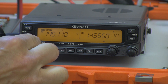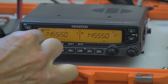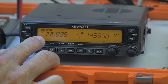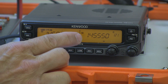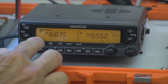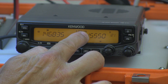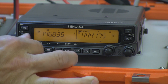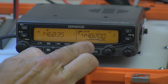As you can see here, here is your channel number. We'll take it back to channel 1, which is 146.835. This here is the PTT and the controls — so if I was to key up the radio, you can see it there. That is on the A band. If I want to go to the other B band, I simply push this button and the PTT and the control moves to that band. Let's take this down to channel 2: 443.200. You can see it's on there.